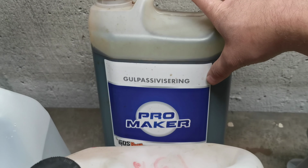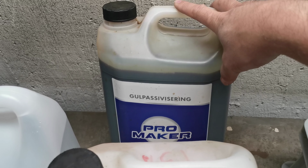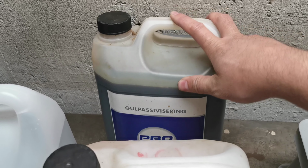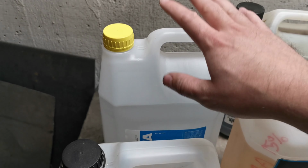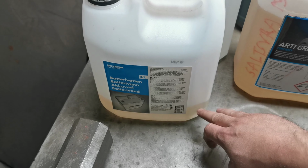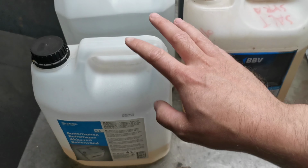We have the yellow chromatization fluid, yellow passivization, whatever you want to call it. It doesn't have the dangerous chrome molecule, but this will turn it yellow. This will make the part ready to become yellow, so basically open up the pores. Then we have some distilled water. This is what I used before when rinsing off parts after the hydrochloric acid, and I bought some extra just so I can fill one container.